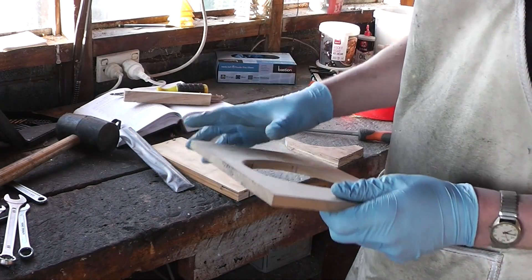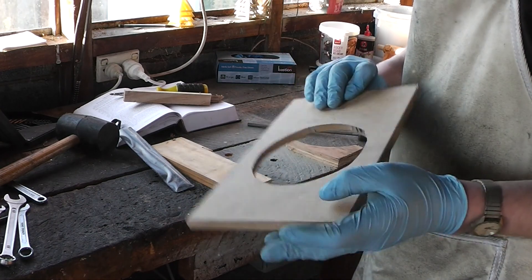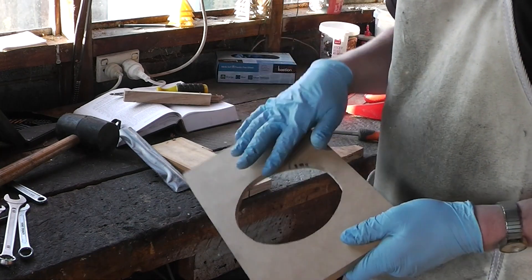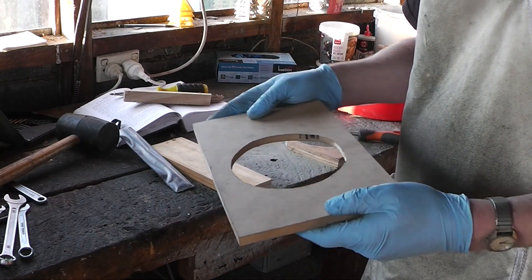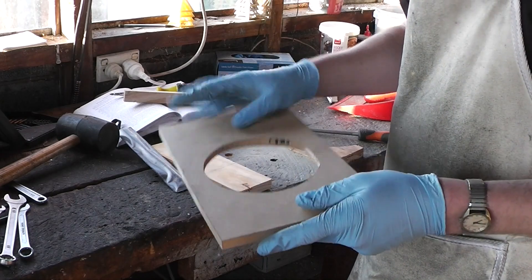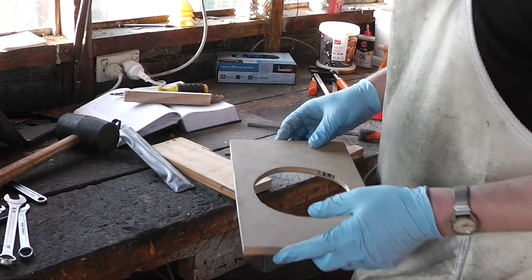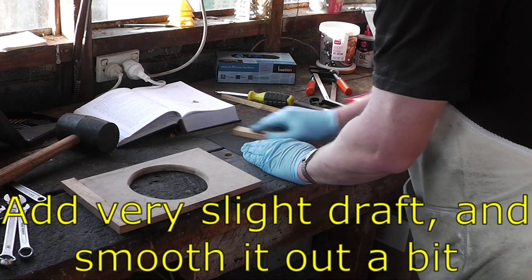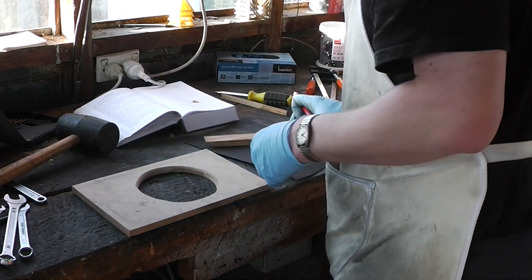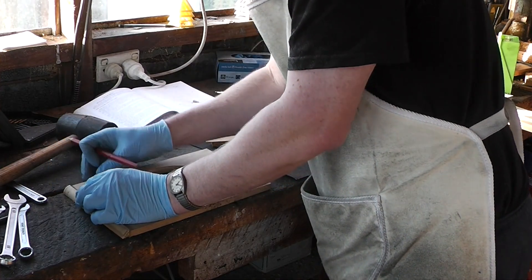There's a horrible circle but it should mould up nicely. I'm not going to be rounding over this surface because this will be on the parting plane — it will lift up this way, so if I put a rounding over the sand will lift when I pull the pattern out. You may recall I deliberately cut these too long, so now I need to cut them to the right length.